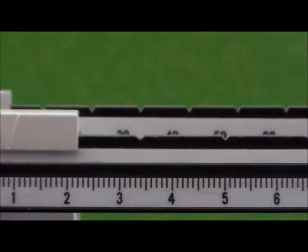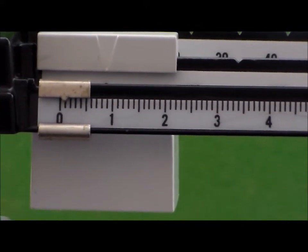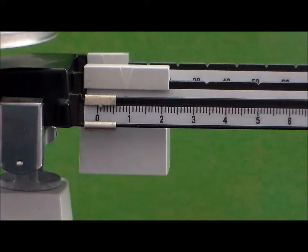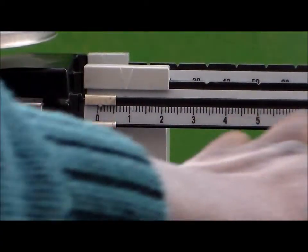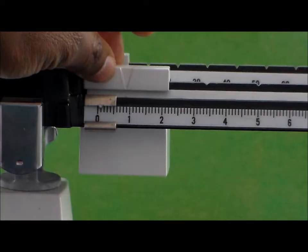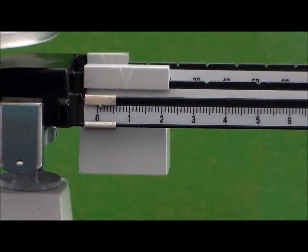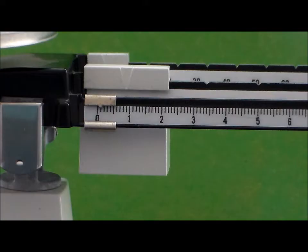Now that we've talked about the parts on the left and right side, let's go back to the center. In the center, we have three riders. We have one rider that adjusts by grams with a max between 0 and 10 grams in the front, one rider in the back that adjusts from 0 to 500 grams, and one that adjusts from 0 to 100 grams. Those three riders are sitting on three different beams, and the beams are these scales in the back. Since there are three beams, we call this a triple beam balance.